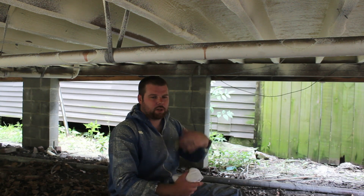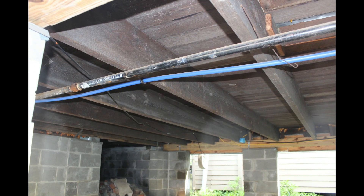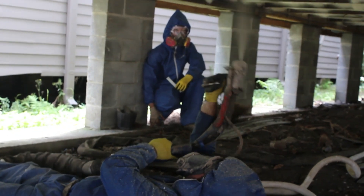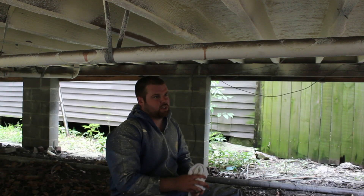Fiberglass doesn't stay up here. A lot of people try to use the netting — it winds up separating itself from the floor. You wind up having that channel where airflow goes through. Plus, even with fiberglass, you still can't seal. You can go around with a can of foam and try to hit every spot, but more times than not you don't hit everything. So what we do is come in and spray foam the underneath side of your house.